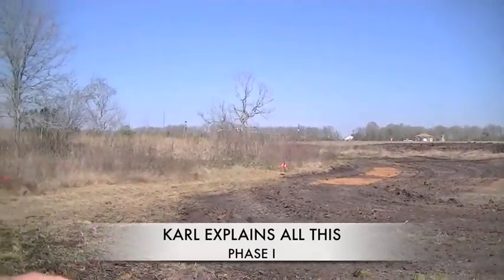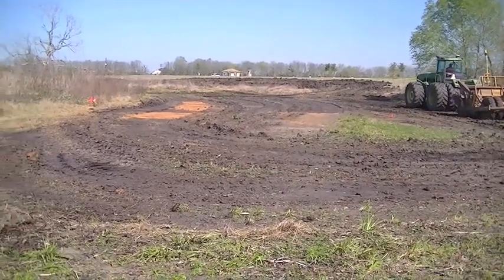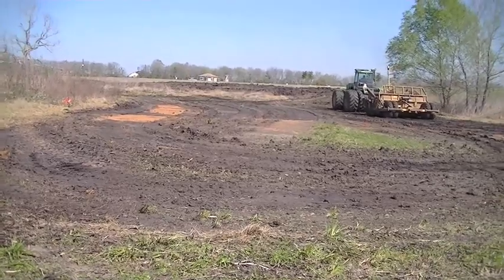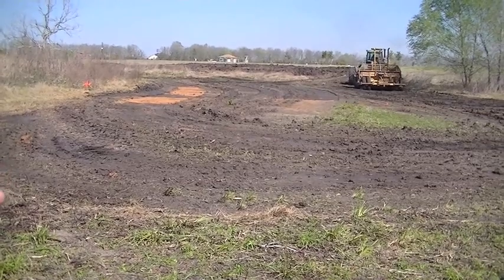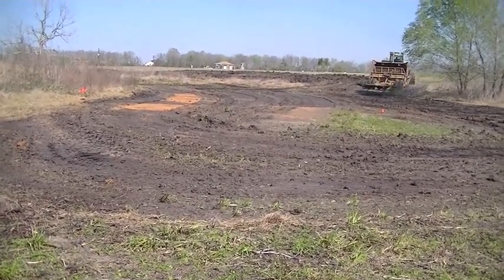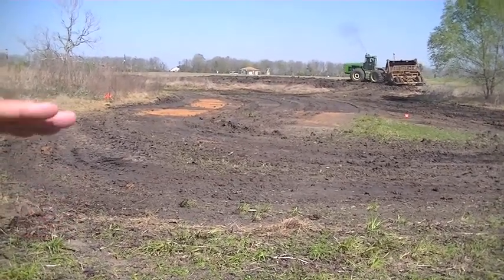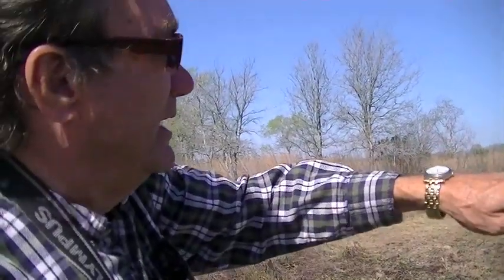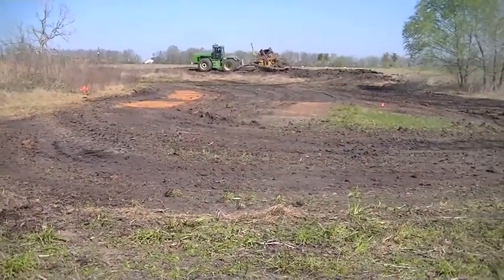We're going to create an experimental pond here, about a third of an acre, and we want to make it 18 inches deep at its deeper point down along the bottom. We're going to layer it with eight inches of heavy clay from up on the surface. So we're going to have to dig it 26 inches deep, then put the eight-inch layer on it, and then it'll be 18 inches deep when it's filled. It'll taper up to the sides along the same contours as the present pond.